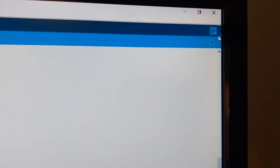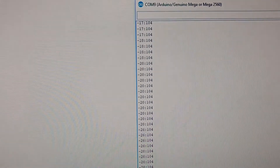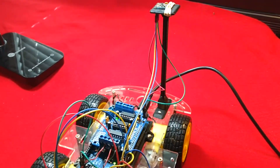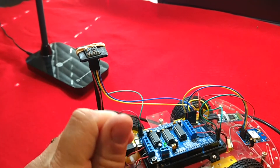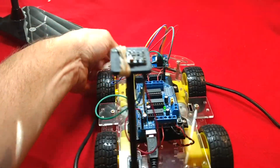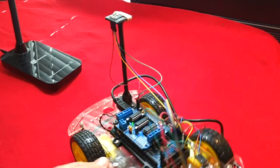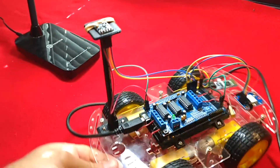Open up the serial monitor and you'll see a bunch of numbers being output - these are showing you the offsets. What you're going to do is rotate the compass around. It's best to have it on the robot or hold the compass yourself, but keep it on a flat level surface. Rotate it around a couple of times, then go the opposite direction, keeping it nice and flat and level.